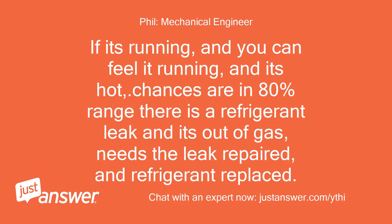If it's running, and you can feel it running, and it's hot, chances are in the 80% range there is a refrigerant leak and it's out of gas, needs the leak repaired, and refrigerant replaced.